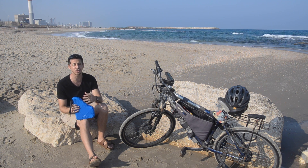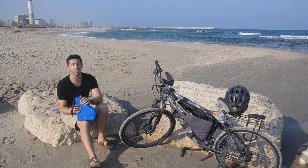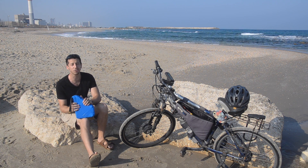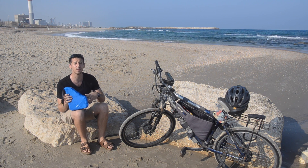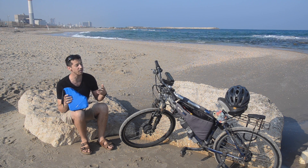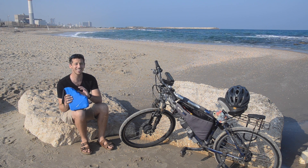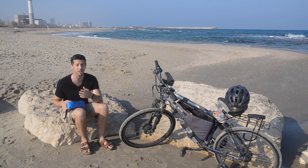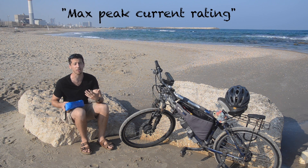I have another video that talks specifically about choosing cells for a battery, so I'll put a link up here — you should watch that if you want to know about choosing cells. But we're going to talk about battery packs at this point. So how do you choose the right battery pack for a bike? The most important thing you want to look at is the maximum current that that battery can handle. In my case, I knew I'm going to pull about 22 amps from this bike, so I need a battery that can handle at least 22 amps. You'll often see two amp ratings on batteries when you look at them online: the first one is the continuous current rating and the next one is the peak current rating.